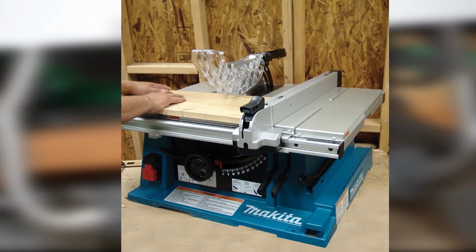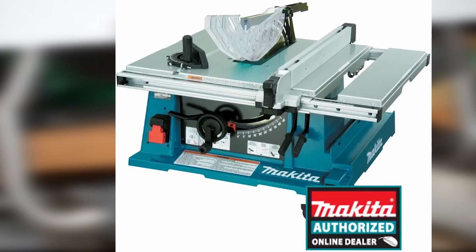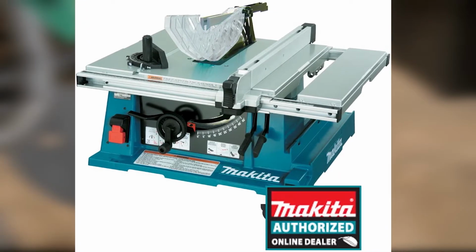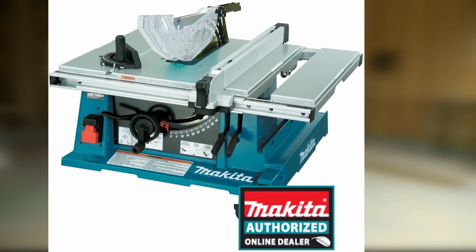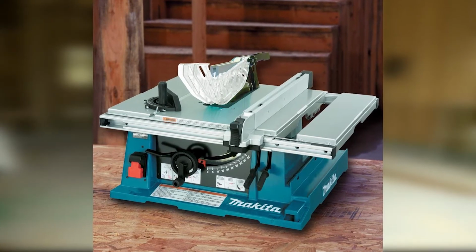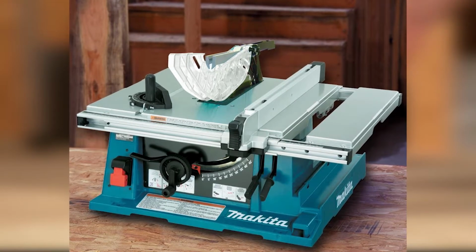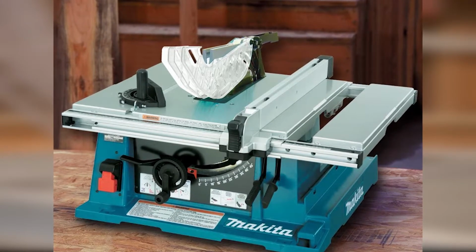All the tools such as the rip fence, miter gauge, blade, push stick, wrenches that are required to be used with the saw come with the package. A 15-amp powerful motor provides blade speed up to 4,800 RPM, allowing the 32T carbide tipped blade to rip through 4x materials even when it is angled in 90/0 or 45/0. An easily readable scale with a magnifying lens helps to make the correct measurements along with the help of the smooth rip fence and extending table. Proper safety preparation is taken with the help of the dual-sided toolless adjustable blade guard, dual anti-kickback pawls, electric brake, and the adjustable riving knife.